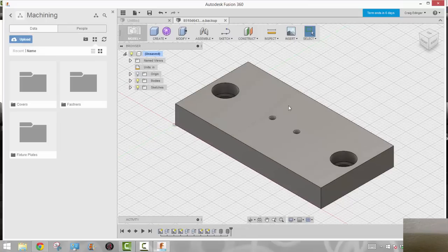In the next video I'll be doing the CAM — going over the different operations to make all these holes: two center drills, then I believe a number seven drill for those prior to tapping, and probably a three-eighths end mill for circular milling there. And then the third video I will be doing the actual machining. Alright, that's it.